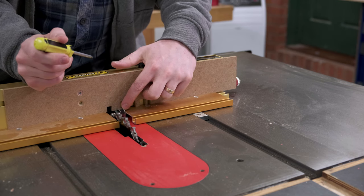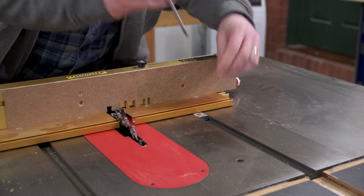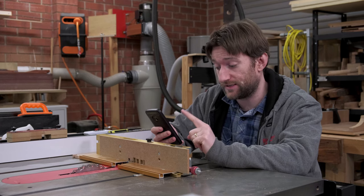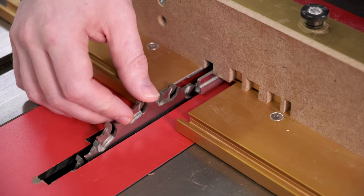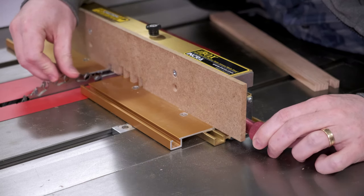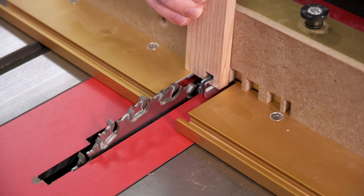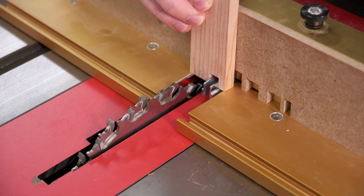What's interesting about this Incra iBox jig is it adjusts the key — both the width of the key and the spacing from the blade — at the same time, because it has a dual pitch screw. Because this is the first time I've used this particular blade set, I need to readjust it so that it references off the tooth side rather than the plate side. We need to adjust the two pins to kiss the side of the saw blade. Once the pins are aligned, I can switch to the main adjustment red knob and adjust it until my test cut fits snugly over the two pins.